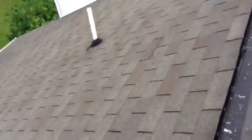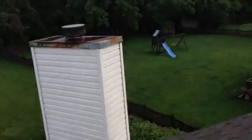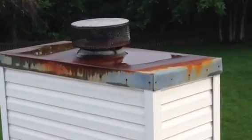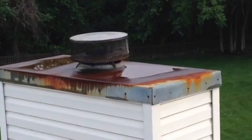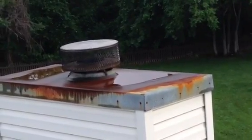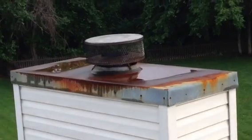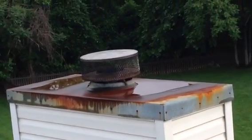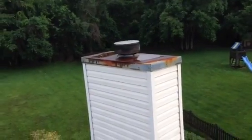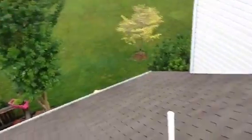We have pipe collars here that are plastic pipe boots. Just to make note, our chimney cap — a lot of times chimney caps get missed, but this chimney cap is galvanized metal and it's starting to rust a little. Nothing serious unless it keeps rusting through, so I'd recommend sanding, priming, and painting that chimney cap to stop it from continuing to rust and having even more problems.